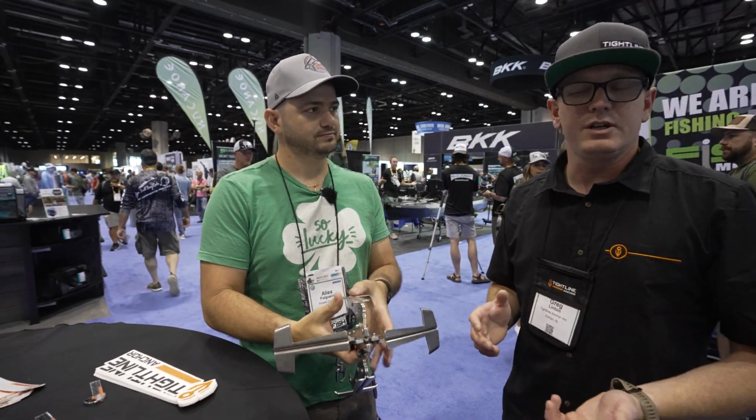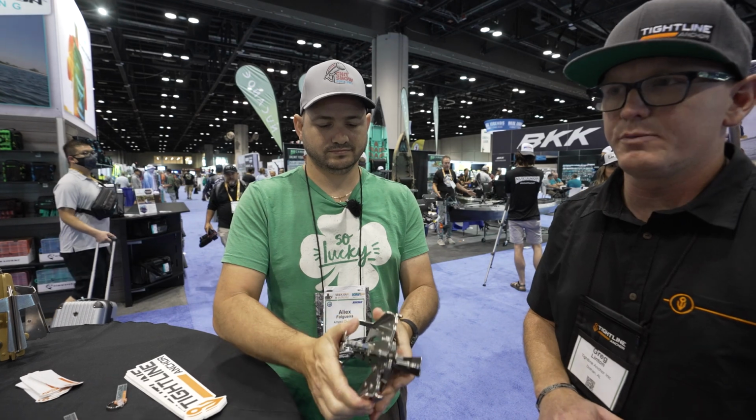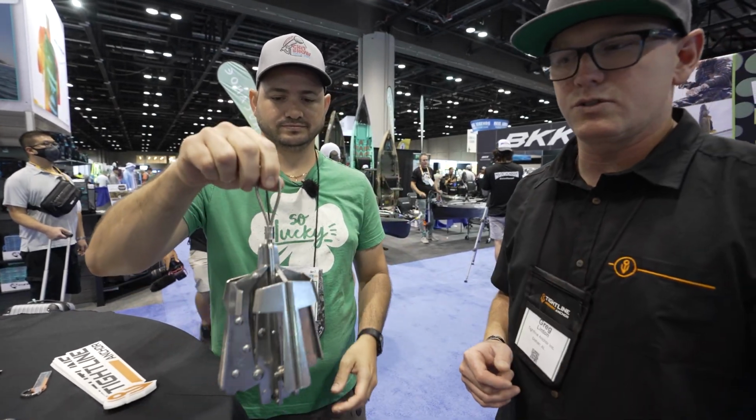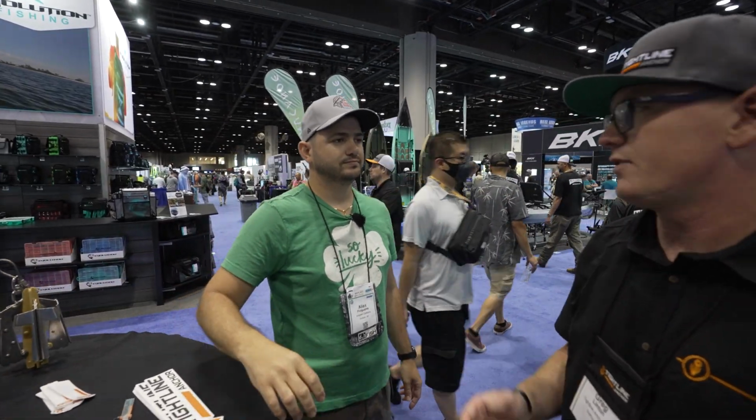If you're in harder to anchor places where the sand is really hard packed or more loose gravel, then you're going to want to have even more rope out so the anchor can lay down and do its job. So you're looking at maybe a 7-to-1 ratio.